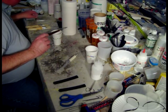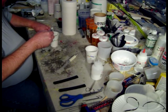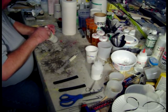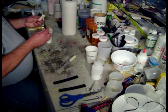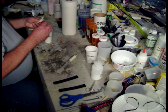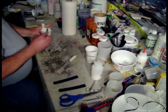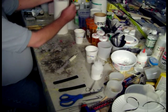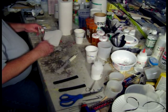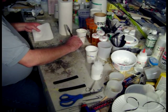I'm going to load up two syringes because I'm doing two halves. Since I'm using the slower epoxy for this layup, I'm going to do both halves with one batch of filler. Normally I'd do one batch of filler per half with a faster epoxy, but since I'm doing the video I should have a little more working time. We'll find out — if I don't have enough, you won't see the video. Now I have two syringes loaded up with filler.